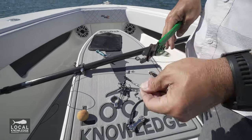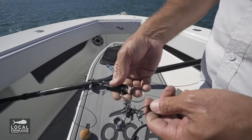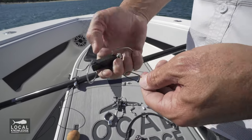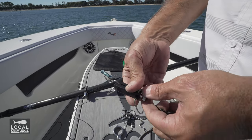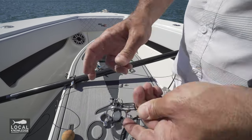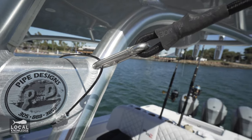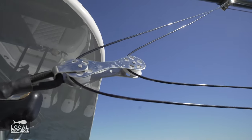Crimp's done. I'm going to go ahead and clip in my release clip. The top of the release clip has got the tension adjustment on it and should go towards the top of the outrigger. Clip it in — that's one side. Now, the important part: in order to size this line correctly, I need to mount my snubber on the boat. The snubber is essentially a tensioner that keeps tension on the outrigger line so the lines aren't flopping around, and you can run two lines side by side without them wrapping up in each other.